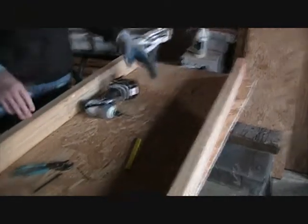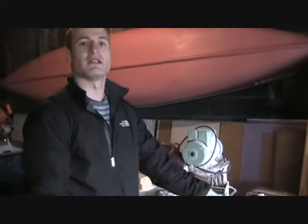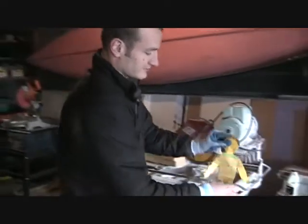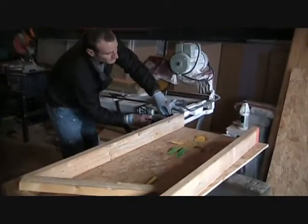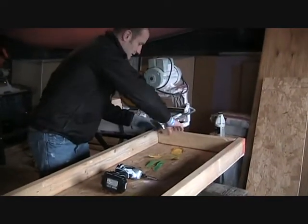We've cut all of our pieces now. We have two long ones for the outside and the back edge, and we have four smaller pieces to go in between, which the plywood will sit on and then the granite will sit on. Stanley, if you could be so kind to hand me the first piece. No screwing around, okay? Alright, so Stanley and I are now going to screw this together. We're going to take a screwdriver, a three-inch screw, put it into our long board and connect our small board to our long boards — like this.